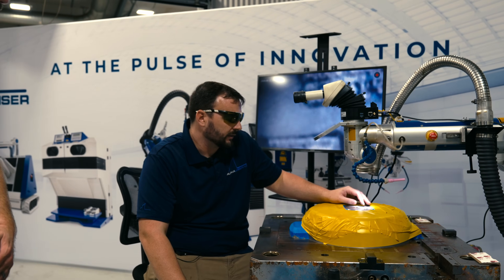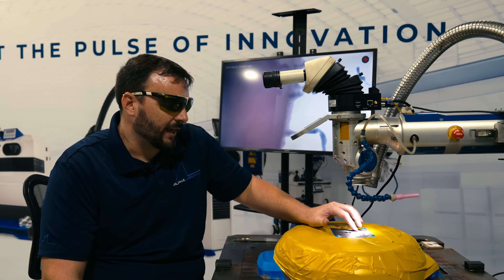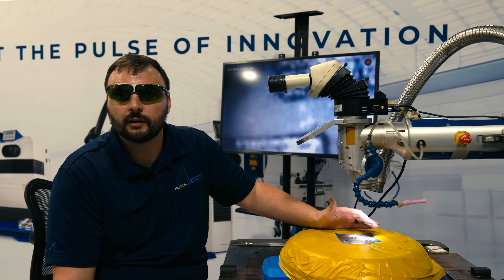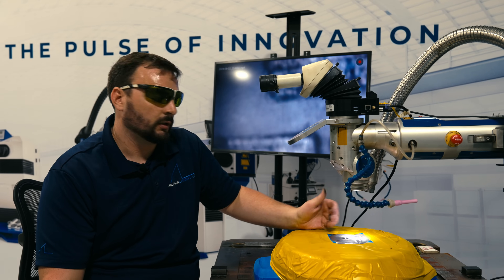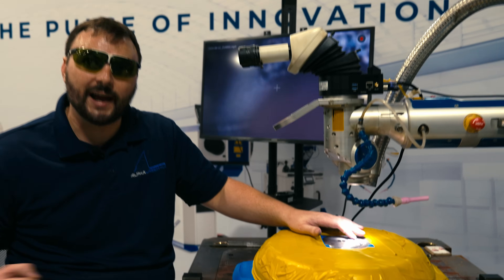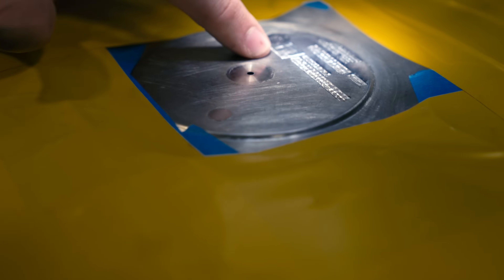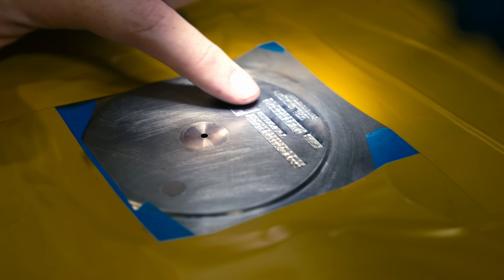My objective here is to try doing this with just one layer of weld wire, so that way I'm not putting too much material on to make it harder for the benching. I want to try keeping it right at the surface, if not just a little bit above, so that way we aren't going back and forth. If you zoom in on this pad here, you can see I am very close to matching the surface but I am proud.